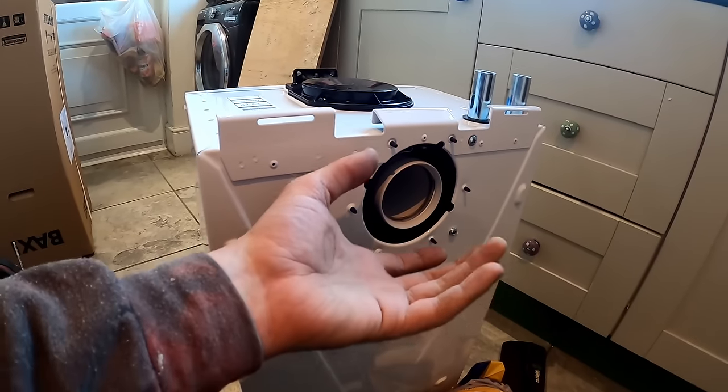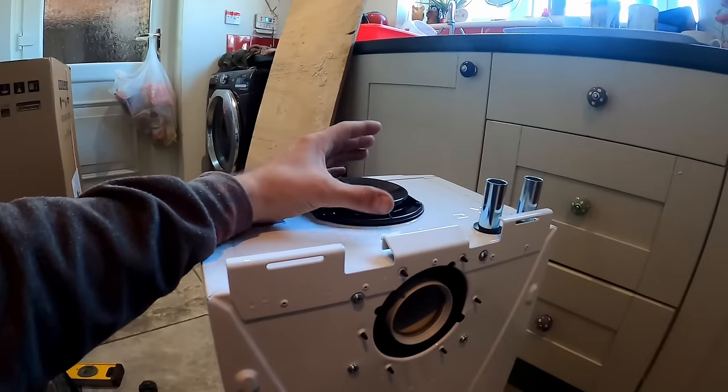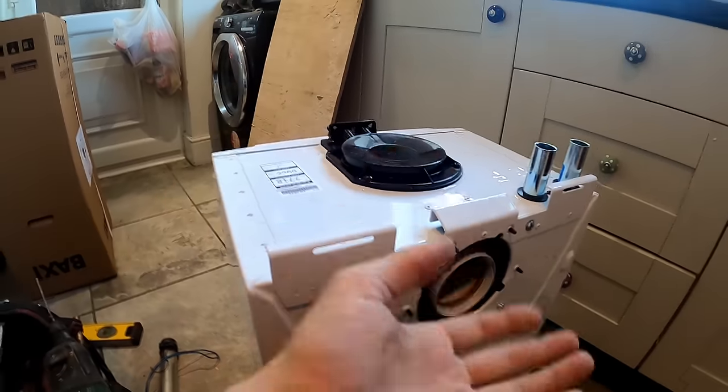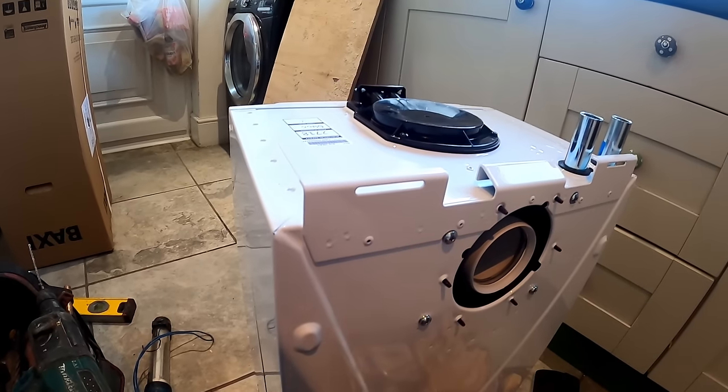It's not that bad — I've just carried that to the van or put it on the drive for the tatman to take. That's the worst bit of the job done. It doesn't get any easier and the older you get, the harder it gets — sorry to any apprentices watching. The good thing with these boilers is it gives you an option of a rear flue. So that's what I'm going to do on this one — a standard Baxi telescopic rear flue kit. You can go off the top if you want with an elbow, and your test points are still there for your flue even if you're rear-flueing. It's just going to be better on this job.